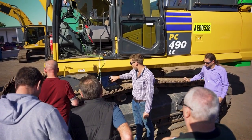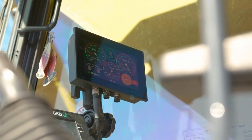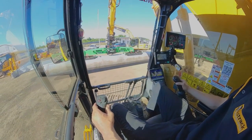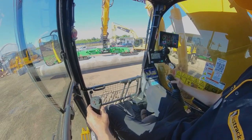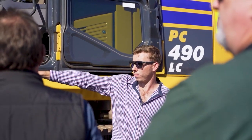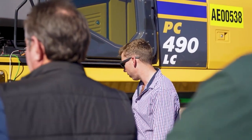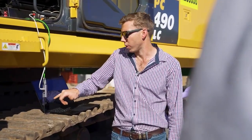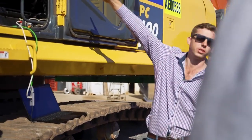What we've got on the laptop here is basically a mirror image of what the operator would be looking at in operation. We have the main tank pressure, which is our reserve pressure in the main tank at the rear, as well as the tank pressure in the beam itself. Then we have our vacuum release and latch icons which are powered through the joysticks of the excavator.